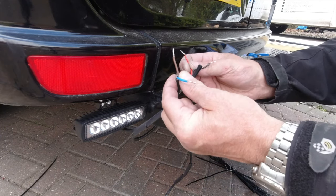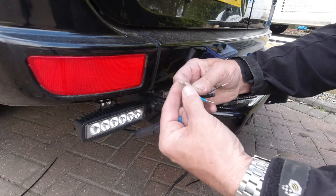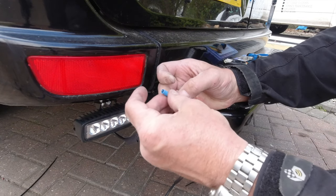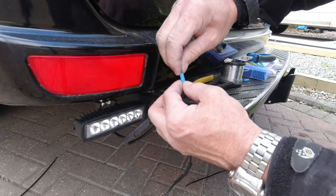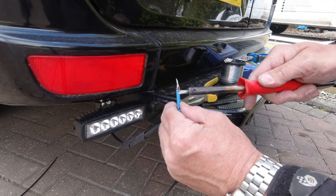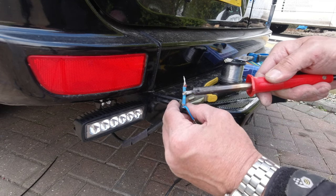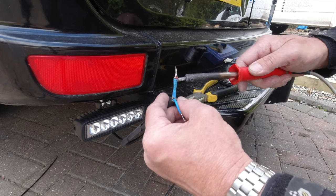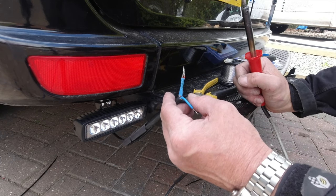To make life a little bit easier when soldering wires together — if you take two wires that you want to solder and hold them next to each other — take another piece of shrink wrap and you can actually hold those two bits of wire together with it. That holds them close together and stops it being so fiddly. Line those up and the shrink wrap — you can use a hot air gun or even a lighter — but I just use the edge of the soldering iron. Apply heat carefully, don't put too much on, you don't want to melt it completely through, but it shrinks and holds those two wires close together, making it easier to solder.